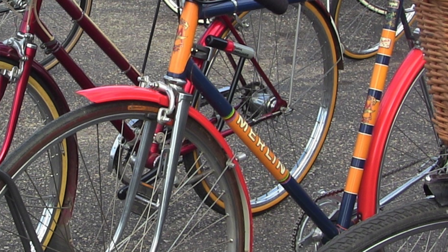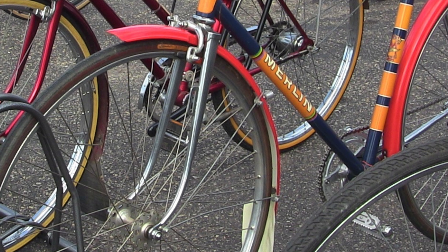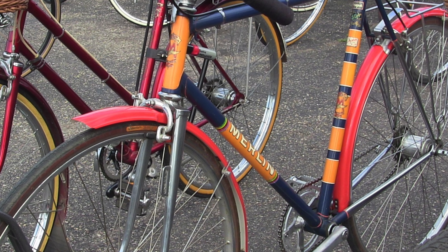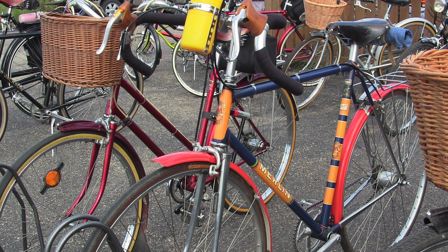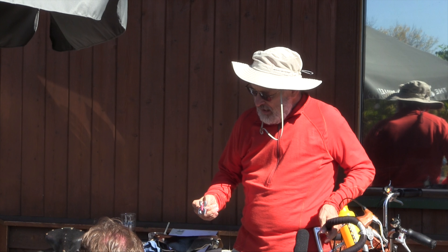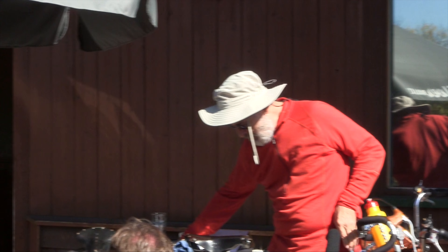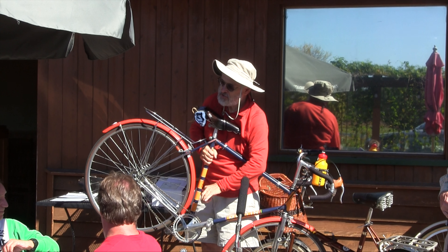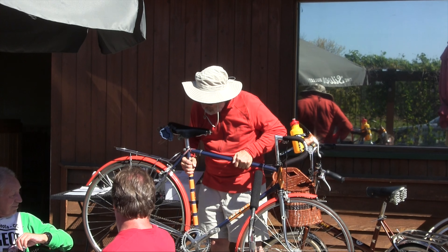The fenders were cracked, so I backed them up with orange cloth and two-part epoxy to patch the fenders. I can't ride full-length cranks and you can't shorten old-style cranks because they're too skinny. But a modern set of cranks, all brightly anodized, would look terrible. So I took a modern set of cranks that didn't look too modern and ate all the anodizing off with oven cleaner. Then, to give a nice vintage-looking polish, you take paste polish like Simichrome but apply it with four-aught steel wool — you get a nice gray dull finish, which is a great way to make new parts look old.